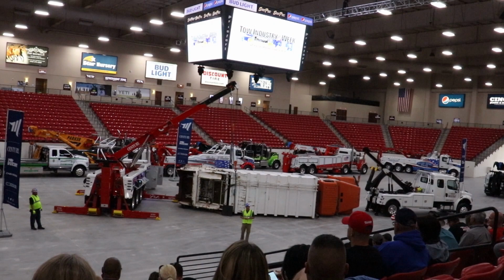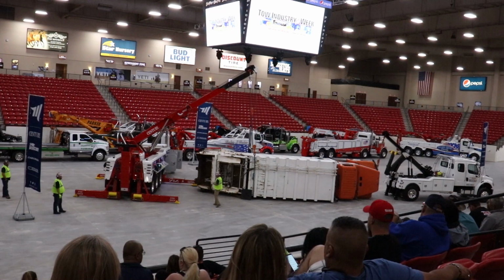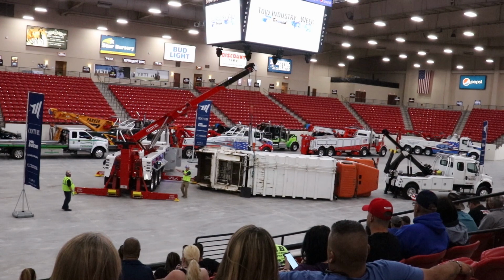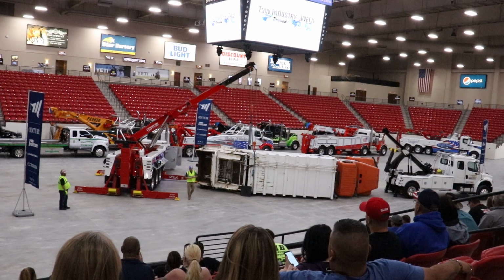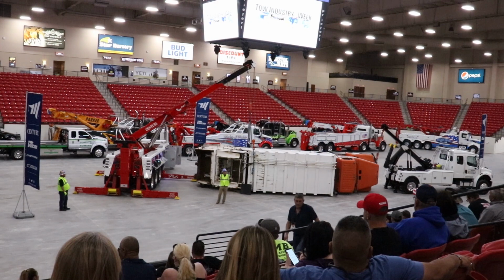A couple things that's happening. As we pick that truck up and get it off, we're transferring that moment arm, or where our pivot point is and our lever, all the way out to these rear outriggers, as far as they can go. The other thing is, as we've lifted that up, we've taken all this weight and placed it over here to counteract what we're lifting on this side. So that's super important. And again, we can back it up with the numbers every single day. So just remember, if you're picking and swinging or if you're lifting, you want to get the outriggers down and the truck off the ground, wheels and tires off the ground, because it will perform better.